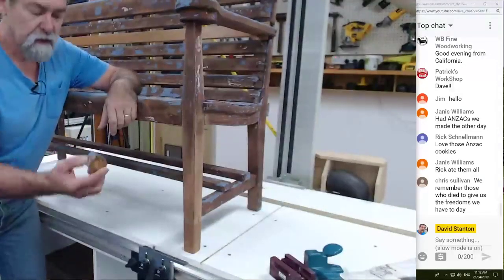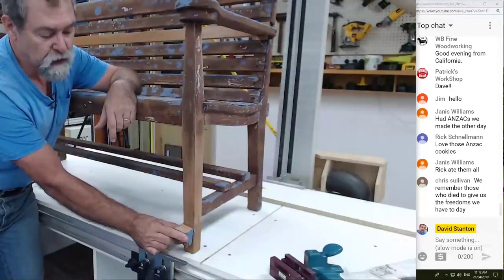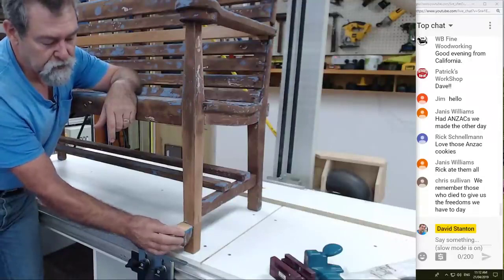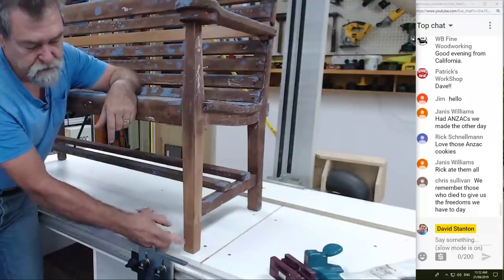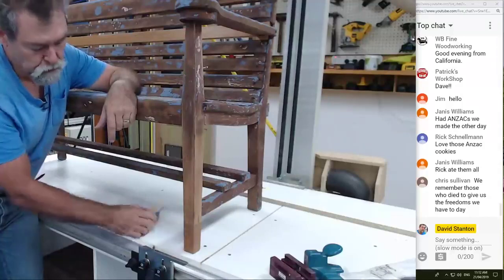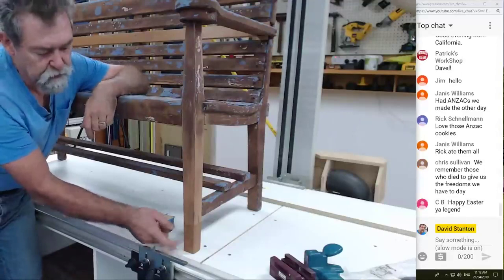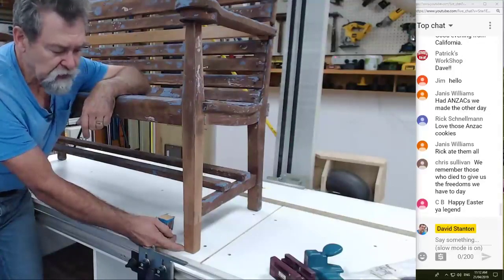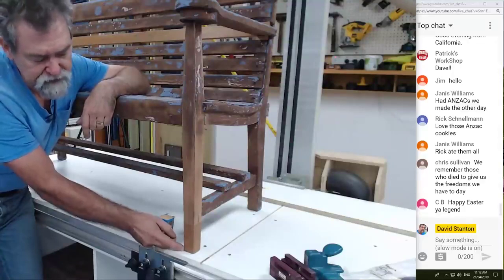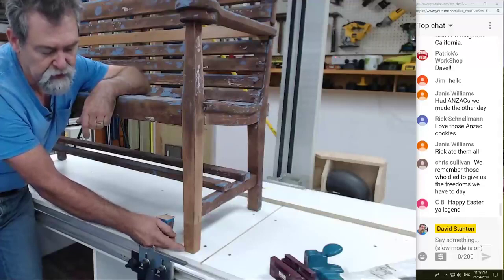This is the leg. This was there, and I cut that off, and you would have seen that happen last week. I cut that off, and this is the piece of Merbau that I've used to replace this. And I did have a gentleman say, Dave, you need to paint the underside with epoxy to seal it. Well, I've only seen it when it goes on, the timber expands and contracts at a different rate, especially outside. And I've seen the epoxy peel off.